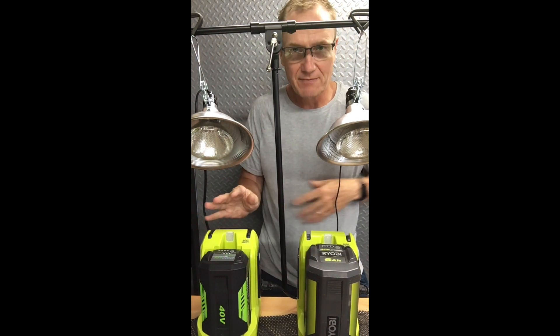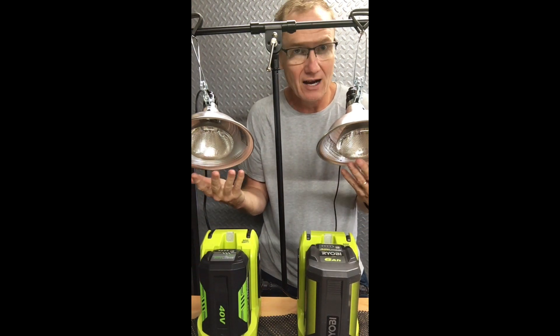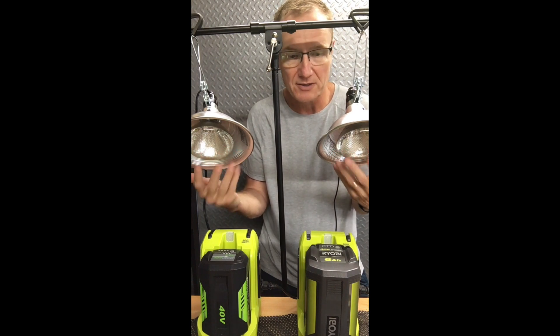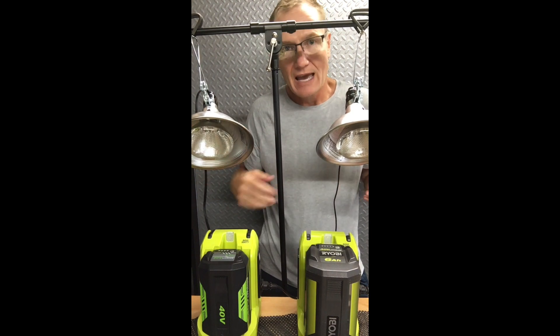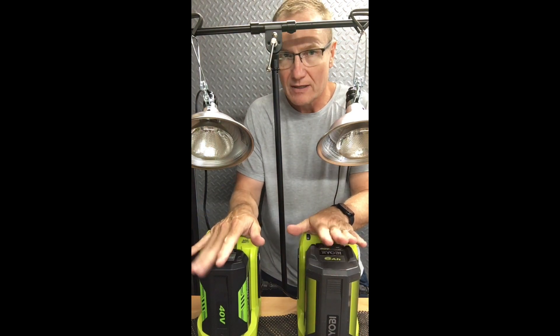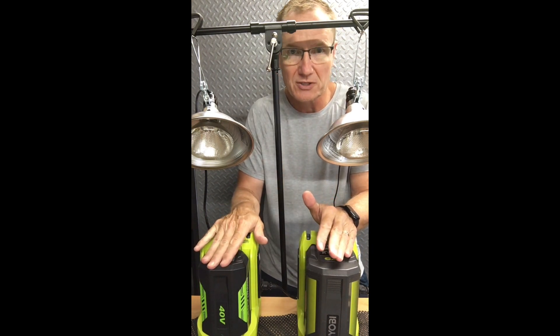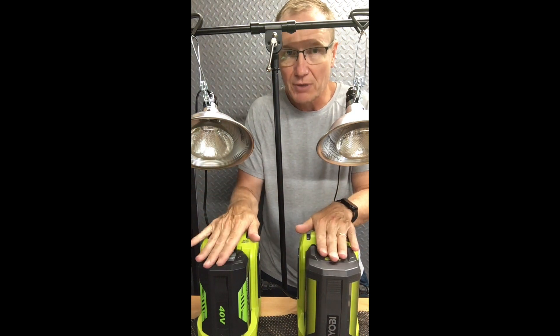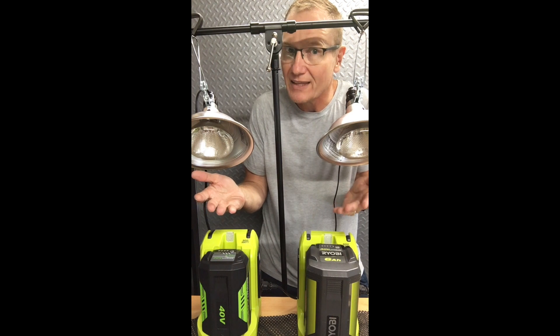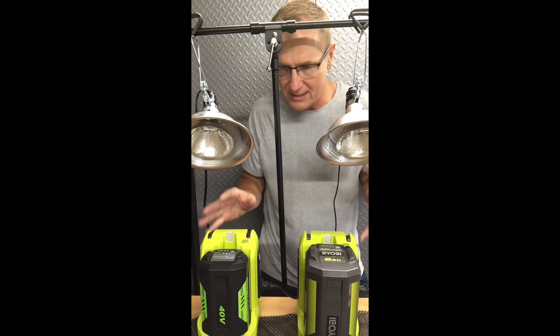I've got them both on the inverters here. These inverters give us up to 300 watts of power. I have two lights here that both have 150-watt bulbs. We're going to turn these on, power these lights, fast forward through the video, and I'll let you know the run time for both of them and my thoughts. Going off the labels, these are 150 watts, so that means this battery at 216 watts and this one at 222 watts should both power these lights for a little over an hour if everything is up to specs. Let's get this test going.